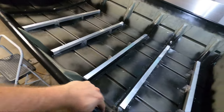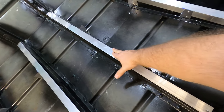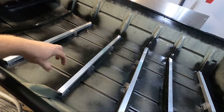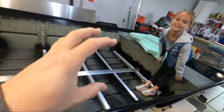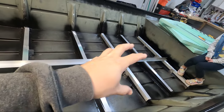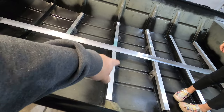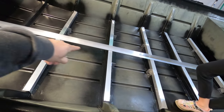We'll have the basics of the subfloor complete. These cross braces are super solid — there is absolutely no flex on the cornered end of the angle on any of the braces. The two braces worked out really well; they're evenly spaced about 12 inches down. Before we get started on setting up the foam for the flooring, I want to install a center cross brace just to give this a little more weight distribution when you're standing on it. The way I'm going to do that is use one piece of angle, notch it out for where the horizontal braces are so it can roll down, and then rivet it in place.